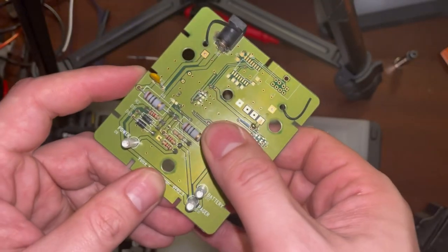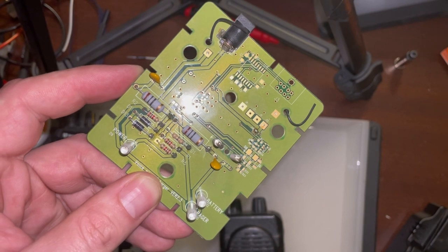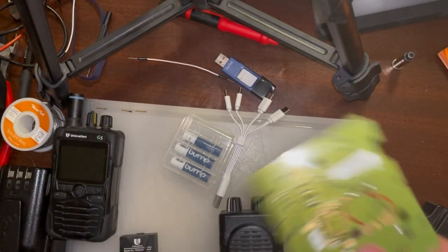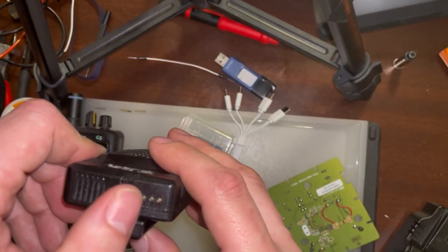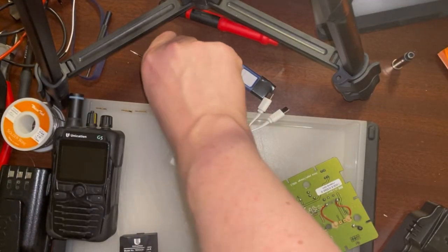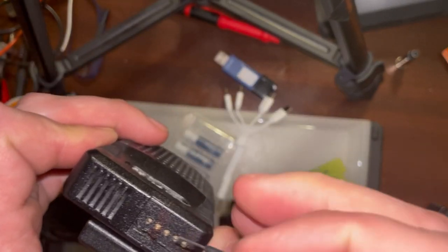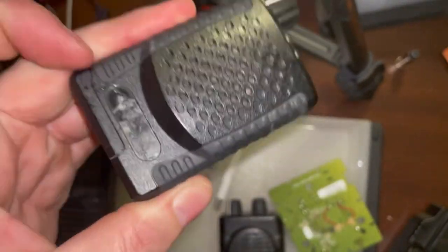This is the charger for the VP101. I was able to narrow down the pinout — I'll insert a video showing how I found it — but the problem is I have no schematic. That narrows it down to three pins: ground, data RX, and data TX. But I don't know how to get this into programming mode; there are no directions and very little information about this single-channel pager.